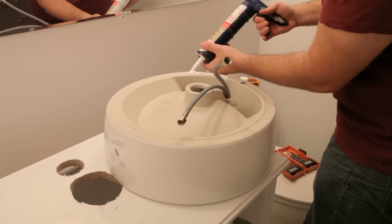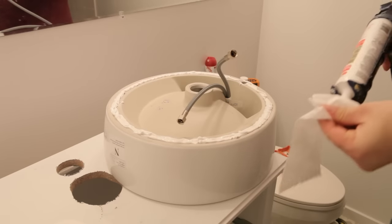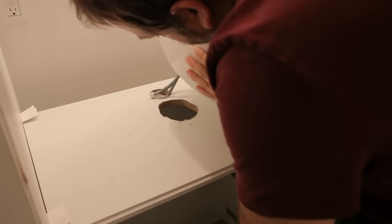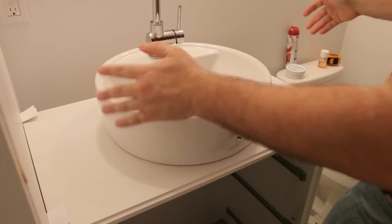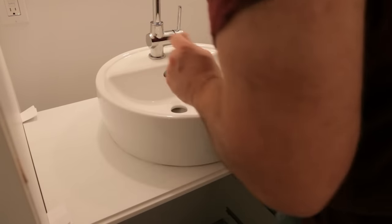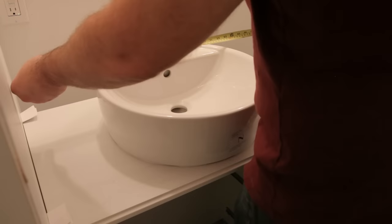The instructions for the sink say you have to fill the inside gap up completely — it's about a half inch of silicone all the way around. Attaching the sink to the top of the vanity with all the silicone is probably the trickiest part of the entire thing. If you put it down in the wrong spot you'll smear silicone everywhere and it's very difficult to clean up, so you've got to be nice and straight when it hits the surface. There is a bit of space to adjust, but try to align it as tightly as possible right off the bat. I still went ahead with a tape measure to confirm it was centered overall, and found I had to wiggle it just an inch here or there.